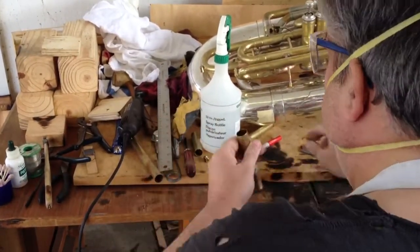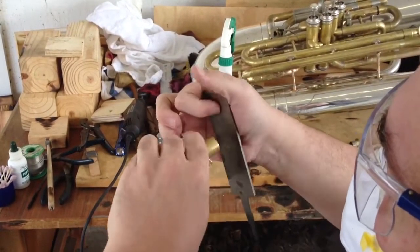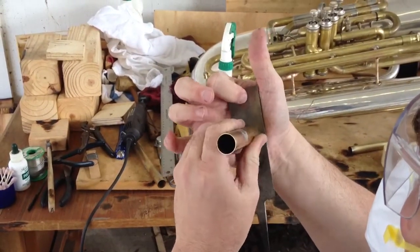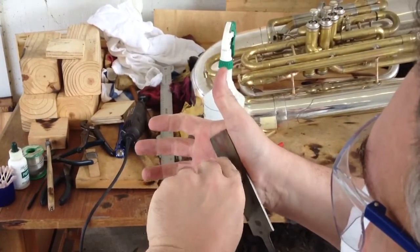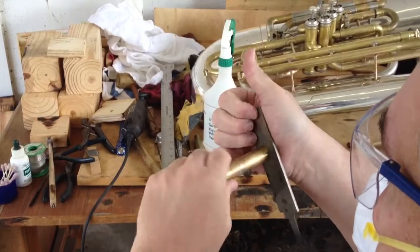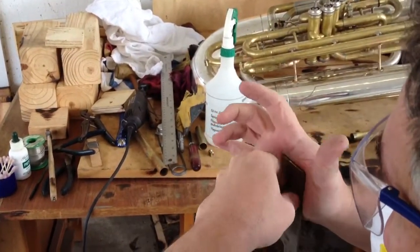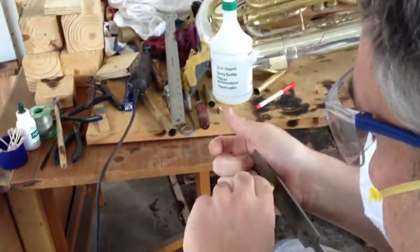Now the inside and outside are more or less clean. I want to make sure it's flat. I set it against the file and twist the tube — the problem is the high spot will pivot, and all you're doing is making it more crooked. You have to feel where the high spot is, dig into that, and twist it like a wheel rotating. You have to put a lot of pressure flat and do it real slow until it wants to turn evenly — like that, starting to free up. When you're done, it should just turn without walking. Almost this entire valve section was done using this method of eyeballing the tube cutting.